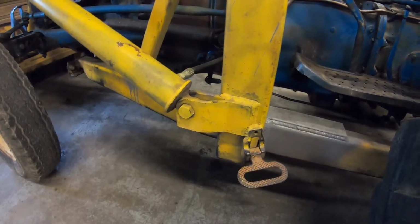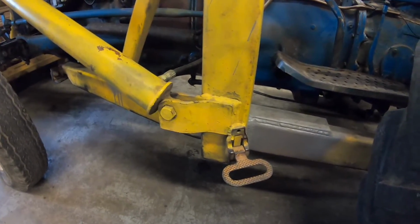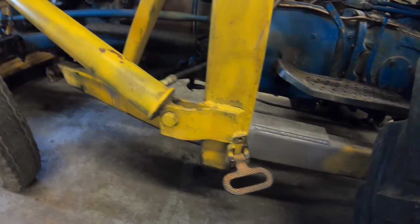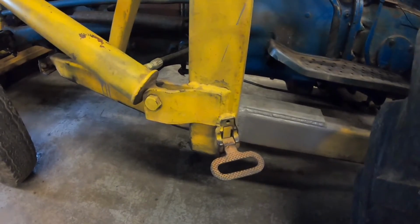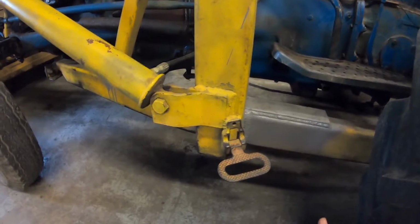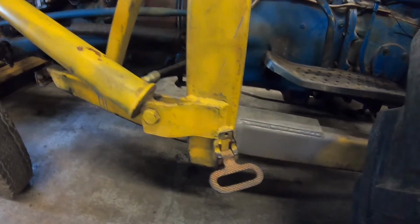It was interesting. Sometimes you've got to do what you've got to do. We had all kinds of stuff, cables and chains hooked up. We had a chain going to the back axle, and a come along to the forklift, and we had the front end loader all the way up to get the weight. And it worked. Like I said, sometimes with these things, there's no manual to tell you how to do it. You have to figure it out as you go. So we got it done, welded it all up, ground that smooth, and then put this plate, about a 12-inch plate, on there.